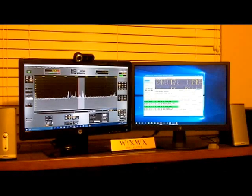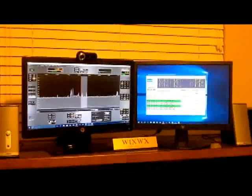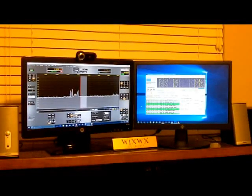Let's start talking about JT-65, which is one of the modes that you can run digital on your radio as long as you've got some kind of sound card interface. On a regular radio, you're going to have to go out there and buy either a Rig Blaster or a Signal Link — these are two sound cards in a box that permit you to attach the radio to the computer. If you happen to have an ICOM 7200, it's got a built-in USB port with a sound card interface and you don't need that extra equipment. I also believe the Kenwood 2000 also has that built-in. In my case, I'm running the Flex 3000, and of course it's always attached to the computer, so another device is not needed.